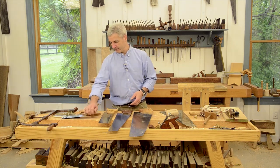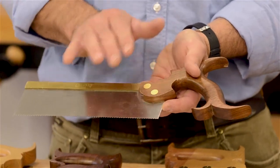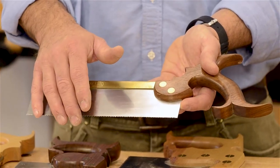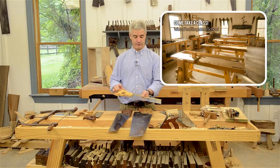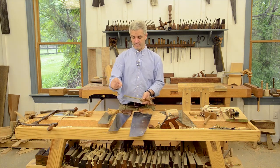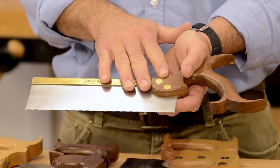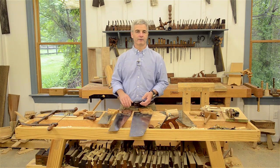And then we have various dovetail saws. With most dovetail saws you're cutting mostly with a rip profile — going with the grain more or less — so generally a good dovetail saw will have rip teeth. Now that doesn't mean I can't cut dovetails with a larger saw. If I was cutting a large dovetail, I'd probably go to the bigger saw; and likewise, if I was cutting a very delicate tenon on something maybe three-quarters of an inch by a half inch, I might go to one of the smaller saws. So don't get too hung up on the names — just think of the type of work you're doing and choose a saw that fits the size of that work.